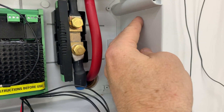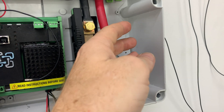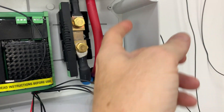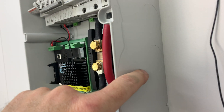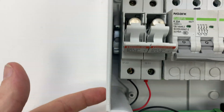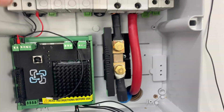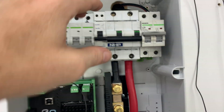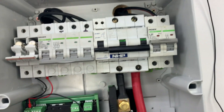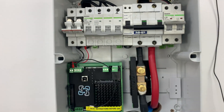I also have to work out my solution for the fan. I'm going to have to buy a 24-volt fan — I've got a couple of 24-volt ones but they're too big and don't have a grill on them. So I'm going to buy a multi-tool or something so I can cut a hole into the side, and then put a row of holes with some gauze along there to allow the hot air to blow across this heat sink and make its way out, so there's some circulation. There's also going to be air going out through the back through those holes as well, though that might make it noisy.